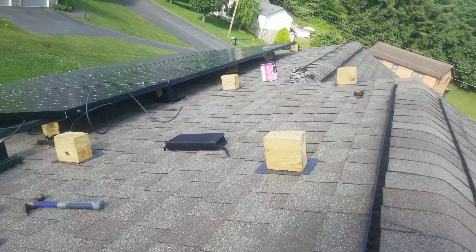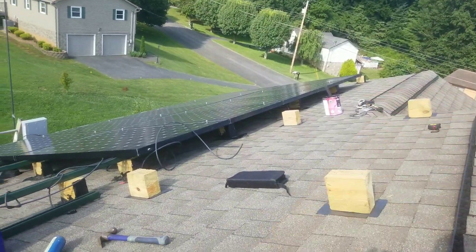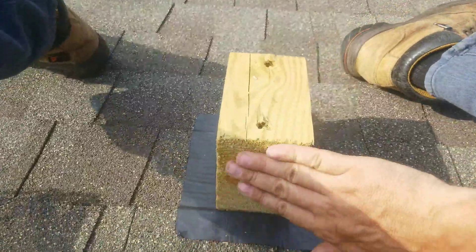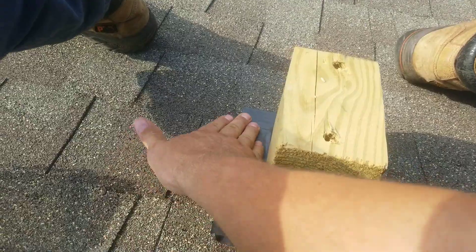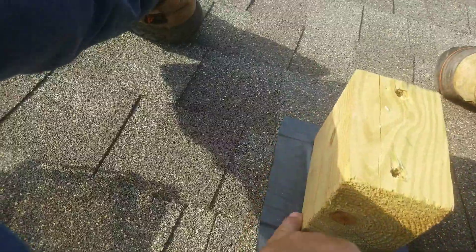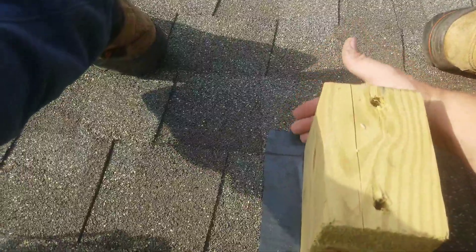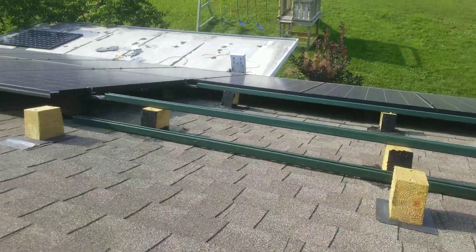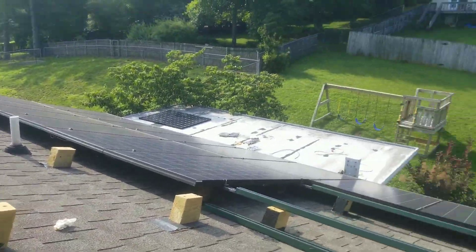Then I'm going to start roof tarring with the roofing cement, or whatever you want to call it. I had to put on those black gloves over there — you can see them. I've got to tar all of it. I'll cover this side completely, then I'll cover the left and the right side, and cover the cracks deep right here. I really don't tar the back of it — it's not necessary. There's no reason to, because water doesn't flow uphill.